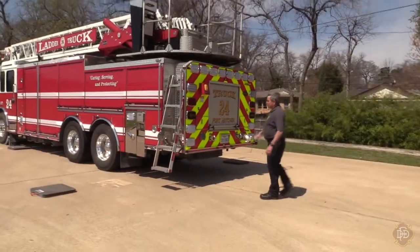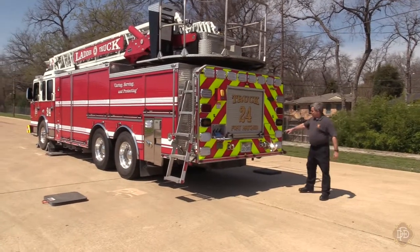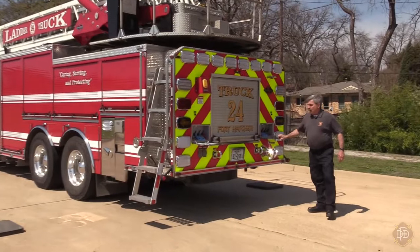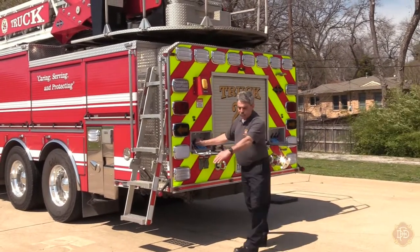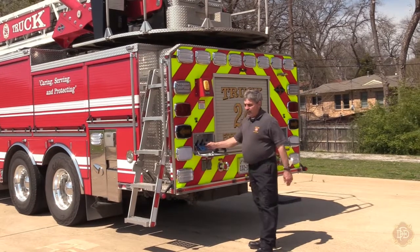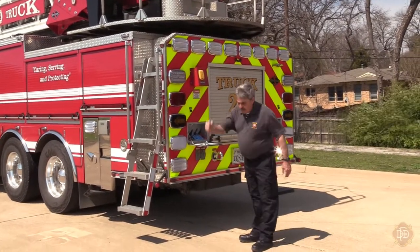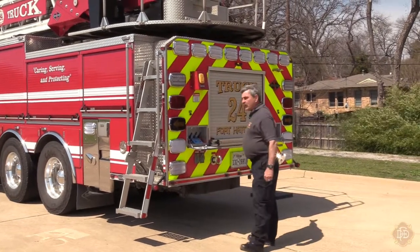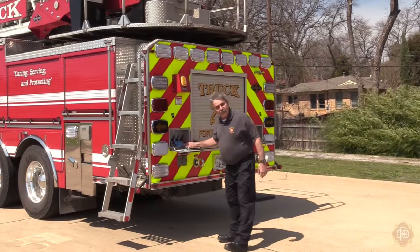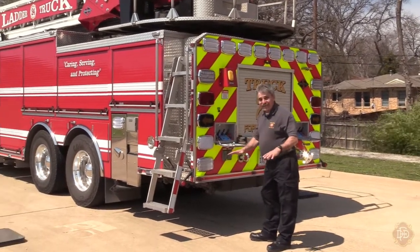Back here in the rear of the unit we have two control doors. Here are your electro-hydraulic controls. You have three sets: a front jack that goes up and down — those are your post jacks — a beam that goes out and down, and a rear jack. You have the same on both sides. Check your green lights to make sure all of them work so that you're properly planted and have weight on the outriggers.